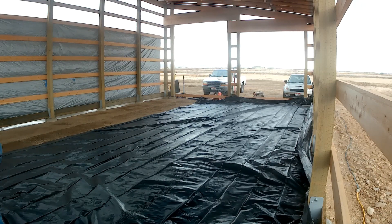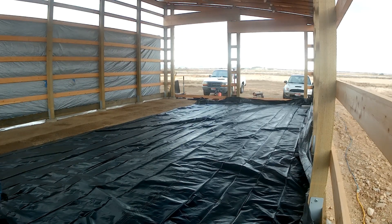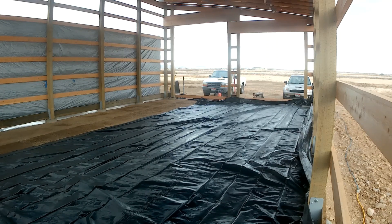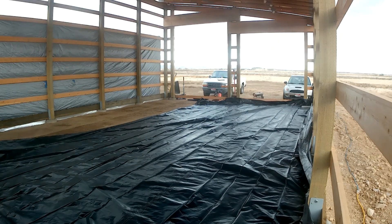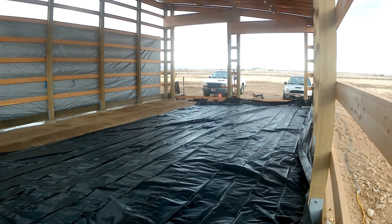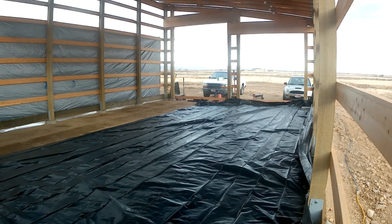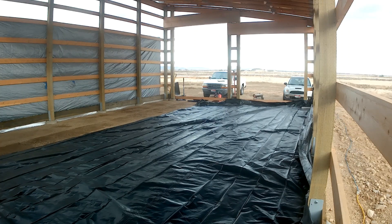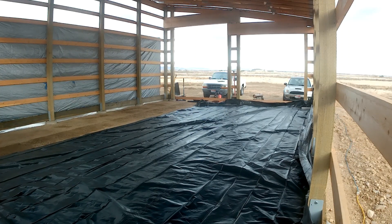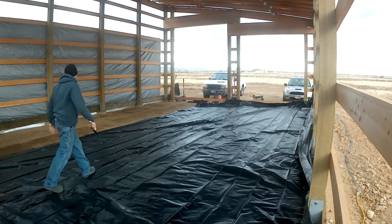As I move across you'll see I go to the front of the truck. What we've done is taken a soda case that comes in cardboard and cut the cardboard down into about two-inch by two-inch squares. We'll place that on the interior side of the poly and staple through it, so that as the floor gets laid and poured and maneuvered over, it doesn't rip out of the board and will adhere to the wall and stay in place better.